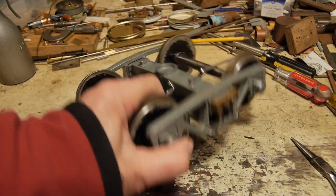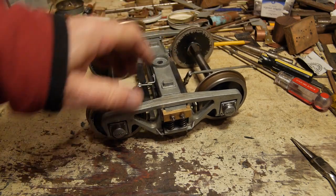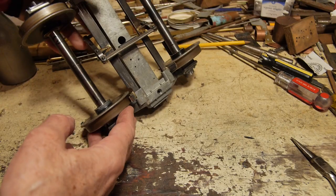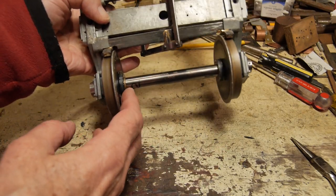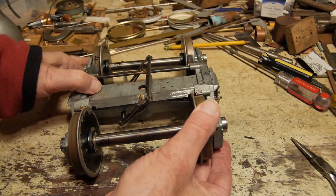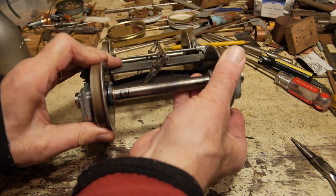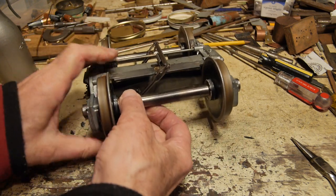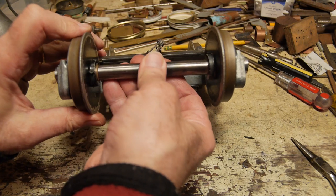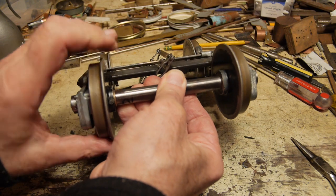What I need to do now is oil round — all these little joints and bearings here, little pins and stuff. Particularly I have to remember to oil the oil-lite bearings here on the freewheel. I've got a freewheel here for going round the curves — one rotates and the other one doesn't. One's fixed to the axle, the other one's on a bearing here, and I've tightened these up a little bit so that they don't rotate as freely as they did, because they were getting a little loose.